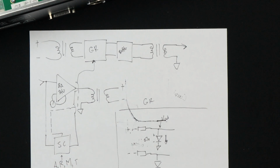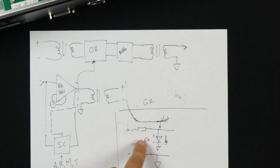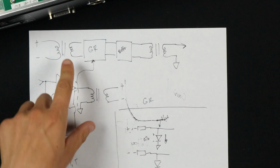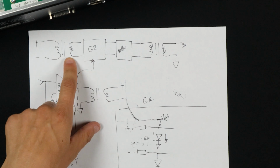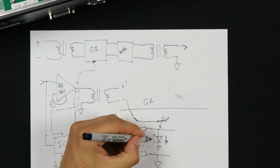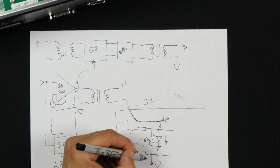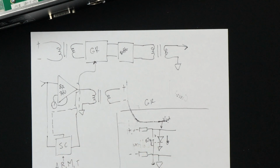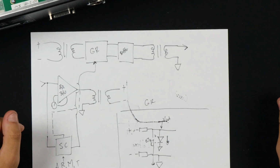It's very clever. I mean, one of the big takeaways is that you need to, first of all, lower the audio level so that it is not going up to 0.7 volts. So there's a good bit of attenuation. I believe the transformer is a step-down transformer, and then there's some built-in attenuation. There's like a resistor here to ground for both of them before the diode. But what's basically happening here is the same thing that's happening in the 1176 and the LA4. It's just a variable resistor controlling a voltage divider. And in this case, it happens to be a diode.